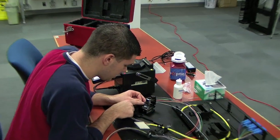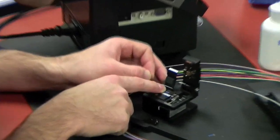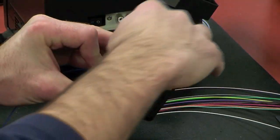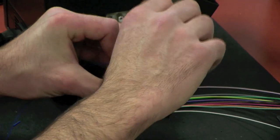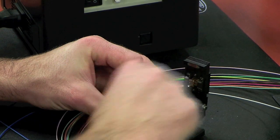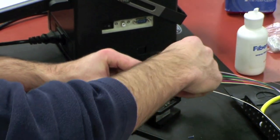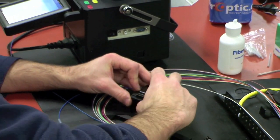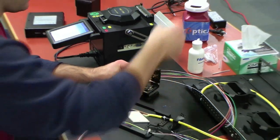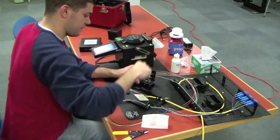Again, laying it in my cleaver. I'm going to get 18 millimeters. You can see 18 millimeters. Close here. Make sure my blade is towards the front. Close. And one shot to the back. Get rid of it — scrap fiber.